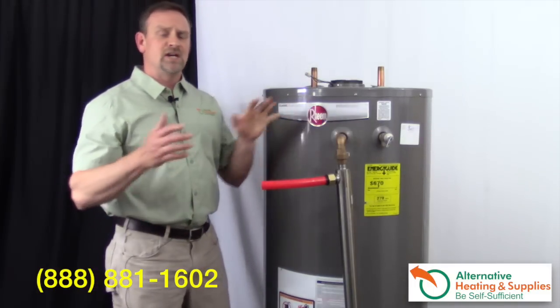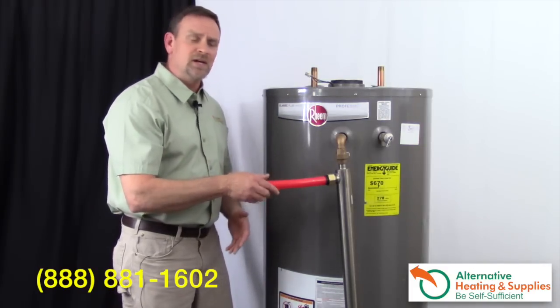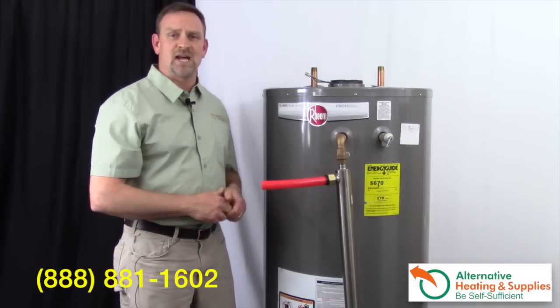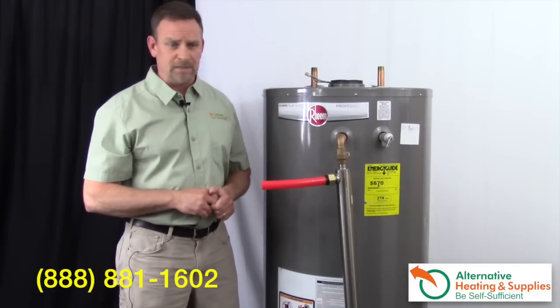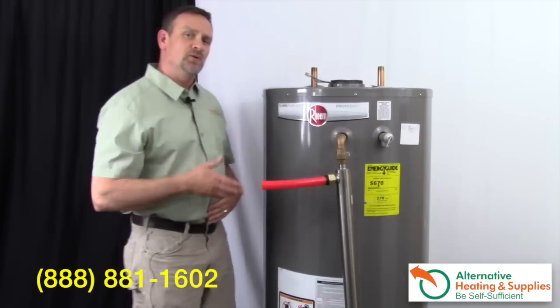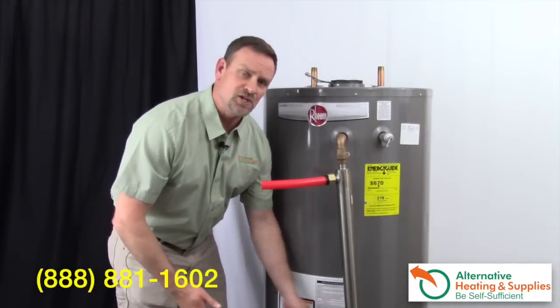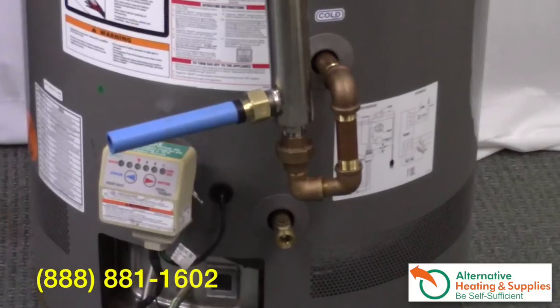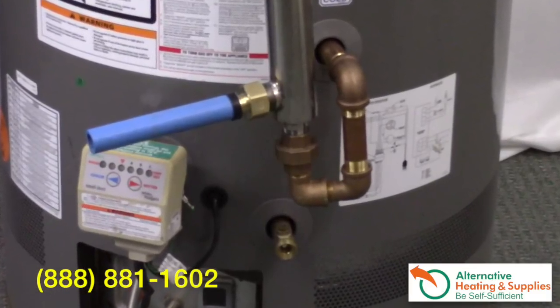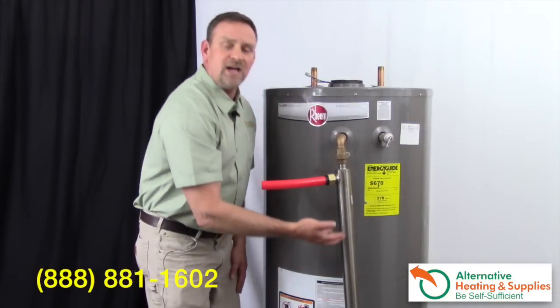You're not running a pump. Just the convection of the hot water coming in from the boiler and the natural convection of the domestic hot water tank is going to give you all the hot water you'll ever need. The coldest water in the tank drops to the bottom and gets heated up again. That's what cold water does — the coldest water drops, and as it heats up, it rises.